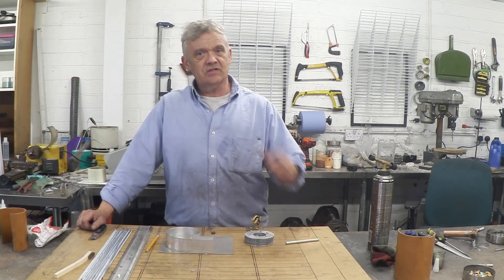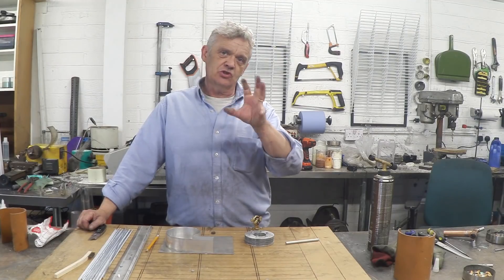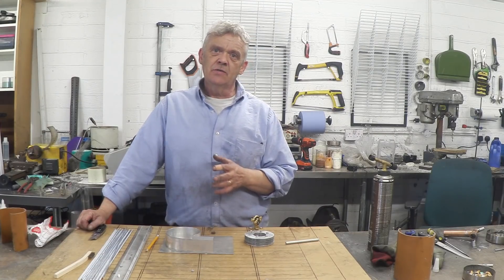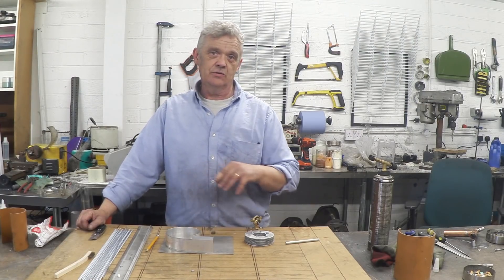I was thinking about Tesla turbines. The common way of making a Tesla turbine is actually in pump configuration — you basically cut a circular hole, you make your turbine, you drop your turbine in. Now, when you're using Tesla turbines for wind, you actually use something called an involute, not an actual circle. I'll give you a close-up of this here, because that's an involute.